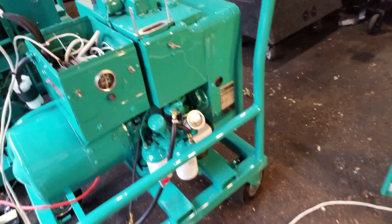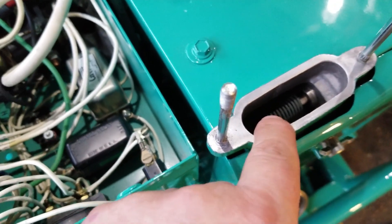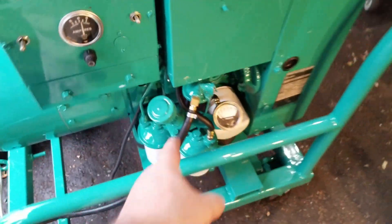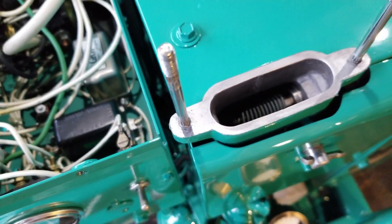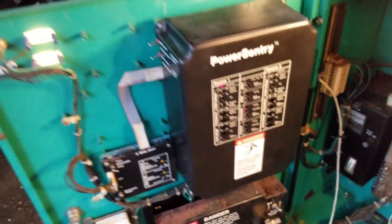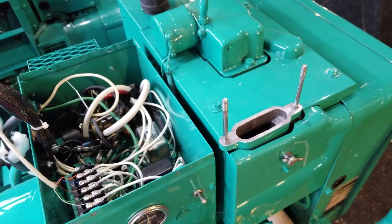Hopefully it will go through its normal steps and wake up this diesel generator — it's a single cylinder DJA, by the way. Hopefully it'll start it, but before it actually tries to crank it over, I expect that the preheat plug — which is this coily thing — to get cherry red, bright orange, whatever. There's also a glow plug in the cylinder, but obviously you're not going to be able to see it in the video. I'm going to focus in on the preheat plug and see if that turns cherry red before it starts cranking. I can set all the timings through the power sentry box, and I expect within time the generator should start up and then the glow plug go dim, then off.